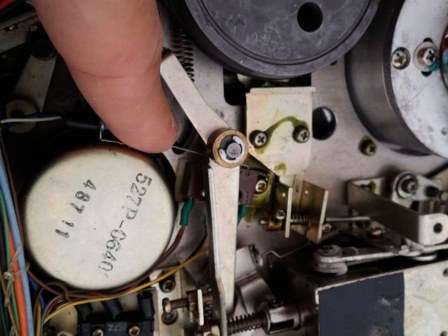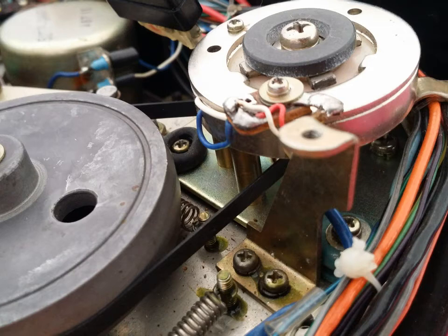I was checking and cleaning all the connectors. They were seriously corroded because they have silver-dipped pins. I had to go in there and clean them with the famous stuff called Deoxit and clean all the connections. Sometimes corrosion on those pins will cause issues with problems connected to circuit boards.